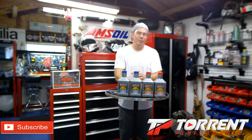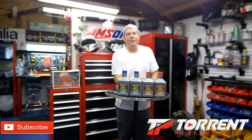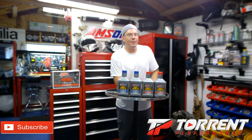A lot of people ask what "double your service intervals" means. What you'd do is fill your hydrostat with the Amsoil fluid. If Amsoil doesn't have a filter for your hydrostat, use your OEM oil filter, then pull your oil filter off, put a new one in, and refill the hydrostat. You won't lose very much fluid when you do it. You can run that fluid double the interval — so if it's 200 hours, you could run 400 hours. That's where you cut maintenance costs, because having equipment down to change fluid can lose you money each day.